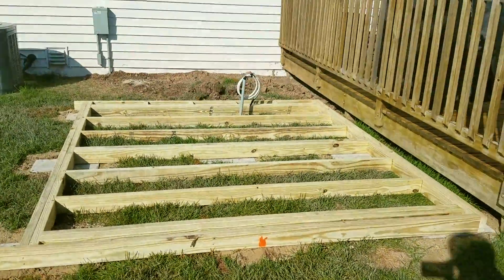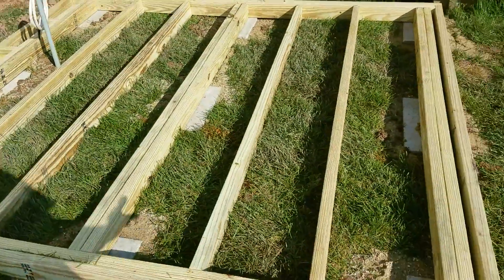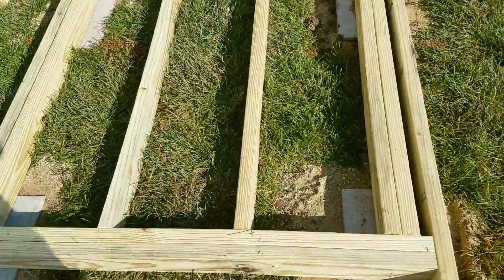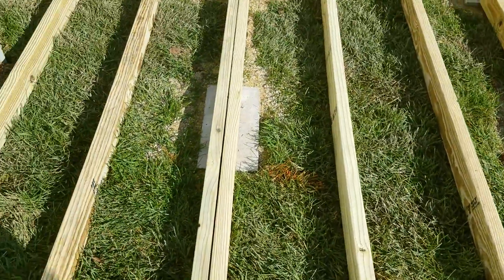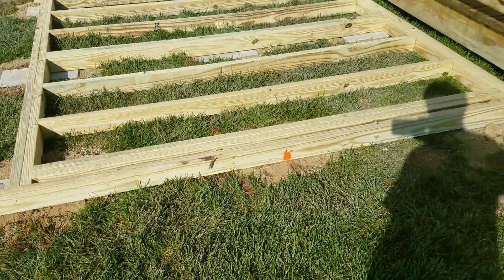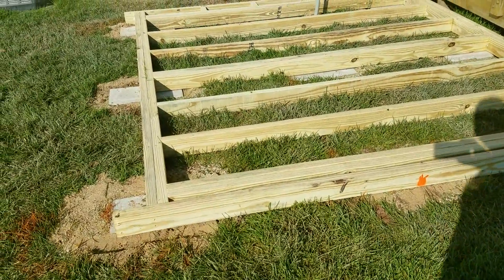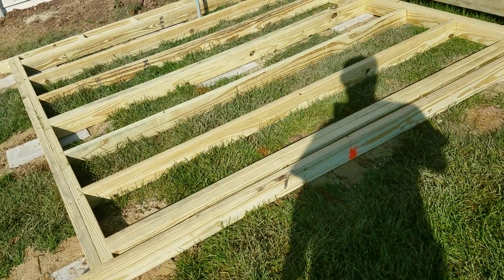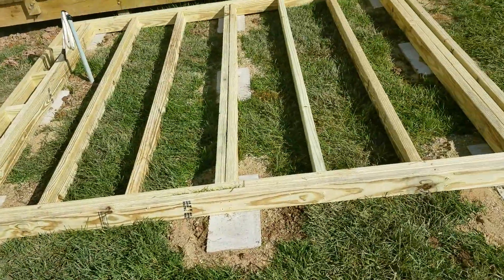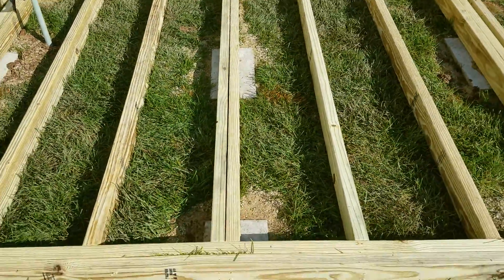Hopefully that'll be right. I saw a couple of other YouTube videos of people that built wooden bases, and I kind of started out that way but ended up with a little variation of it. I didn't get a lot of the cross-braces, but I figured once I screw the deck boards over the top that will kind of substitute for that. Basically I've got probably about sixty dollars in ground-contact two-by-fours, box screws, and all day yesterday at 90-degree temperature digging in these blocks, making them all level — they're mostly straight, I screwed up a little bit, but they're still on the block so it's not worth it to redo it.